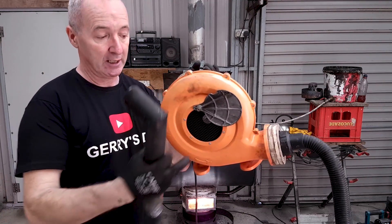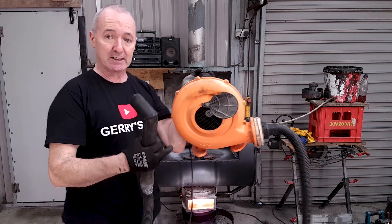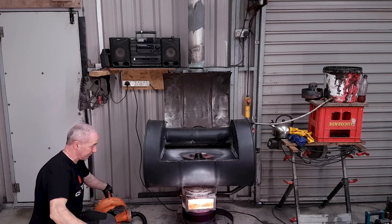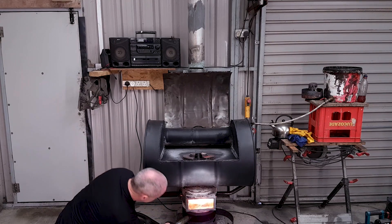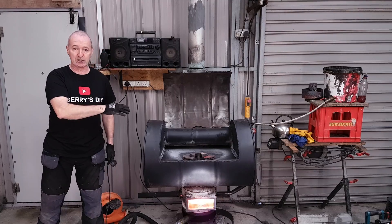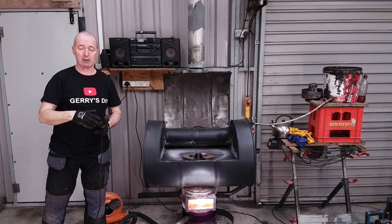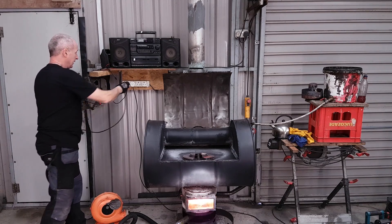Also, this is a slider air regulator off a Riello burner. Matthew Lawrence - thank you very much - recommended that instead of using the dimmer switch I put one of these on. I have loads of these around the place. Fair play, thanks Matthew. So here we go - I'll put this into the unit. I've sharpened this a little bit since the last day and it's a bit easier to get in. Okay, that's it in. I'm going to give it some air. Today is not really about this sort of stuff - I just thought I'd show you the different modification I made to the burner. I put those flutes on it and in operation I can see it is actually turning the flame a bit - instead of coming vertically up it's going sideways further up into the stove. It's just a gentle turn on it. When I put the fan on it I don't expect it to do a whole lot more. The fan is on.